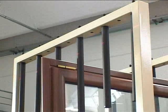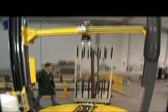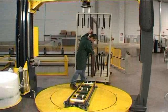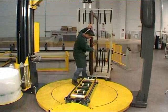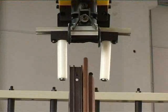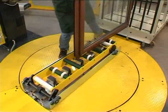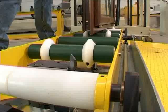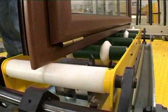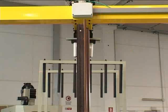Combined with a fitting holder trolley, HE600T, it allows the handling and the packaging operation to be carried out by only one operator during the loading and unloading phases. The pneumatic vise is equipped with a device which prevents accidental overturning of the fitting during the handling. This device is automatically switched off when the frame is locked, permitting a complete wrapping of the fitting.